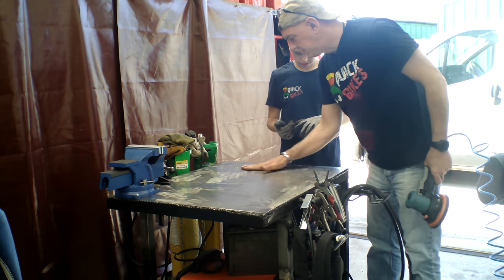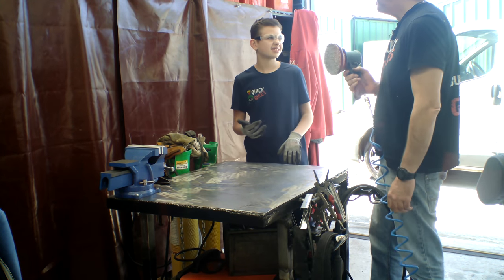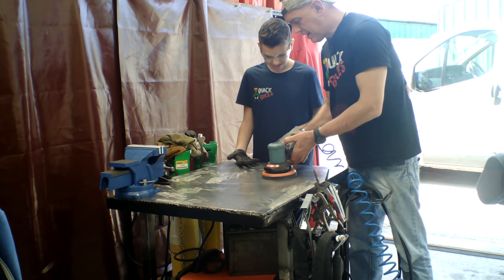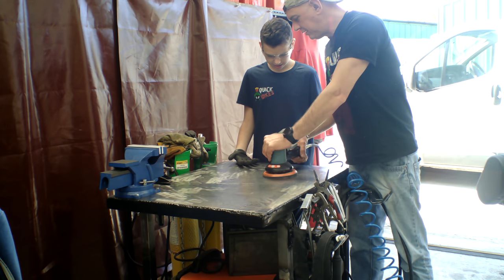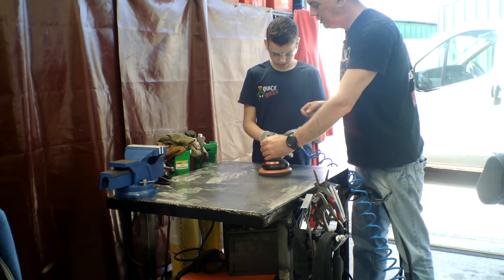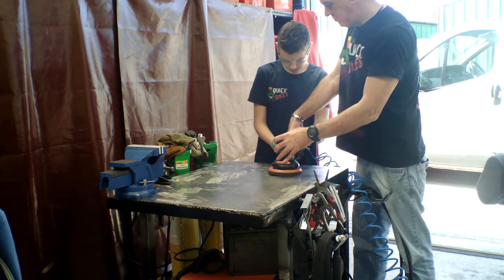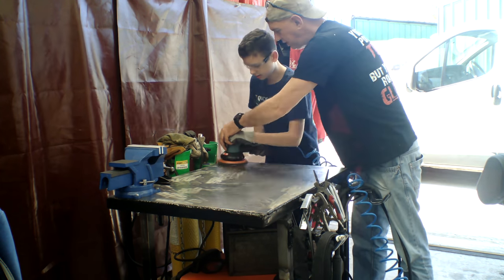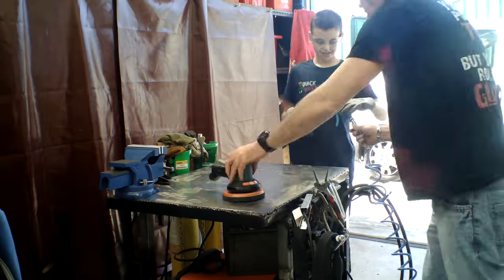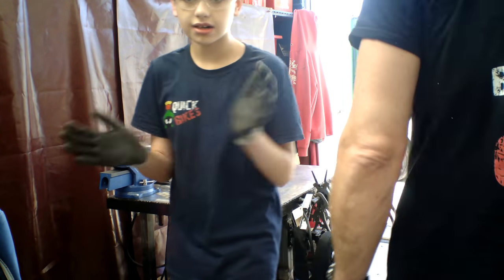Right Jake, this all needs to be cleaned up - it's got little bubbly bits and stuff on it. This is my welding table. Your mum's going to go pretty quick when she sees this. This is a power sander - a DA. All you've got to do is pull that back and press the trigger, but you have to use two hands, keep it flat, and when it's going go all around, keep it away from yourself. Cool, job well done. Right, this is the mucky bit - take your gloves off.